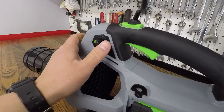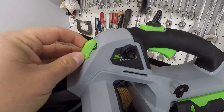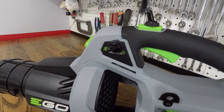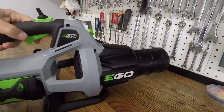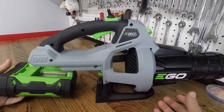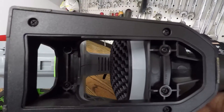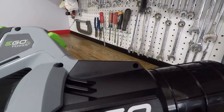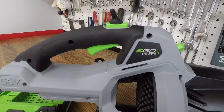To demonstrate, we will turn it on. The first thing you'll need to do is dislodge the battery — there is a notch in the back that releases it. You're going to need to take off the stand, which has four Phillips-head screws. Then there are Phillips-head screws that will separate the two sides of the casing. I'll come back once we have the machine apart.